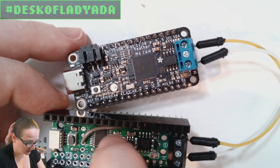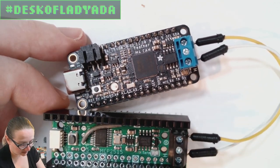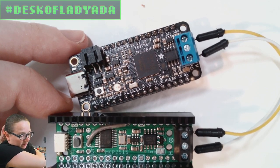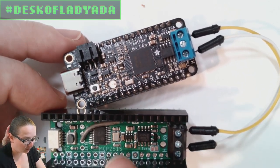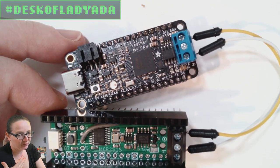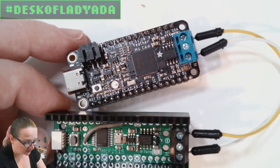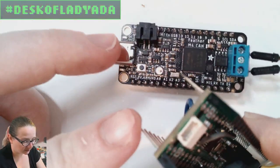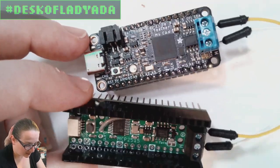I tested the reset functionality, realized that they weren't connected, so I jumpered it. That kind of error, a missing pin connection, I verify by soldering a wire. I don't usually reorder prototypes; I'm usually ready to go into production. I tested the Stemma QT port. I plugged something into the I2C and made sure it powered and worked. I tested the button.